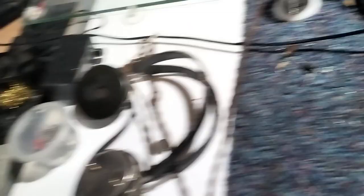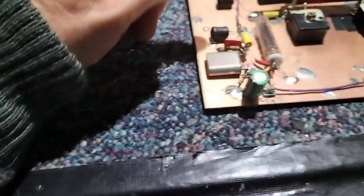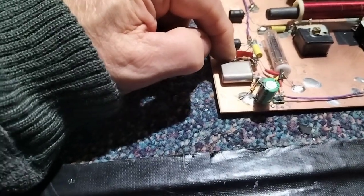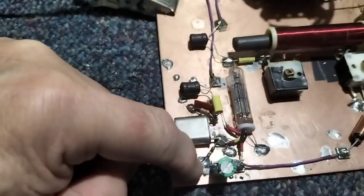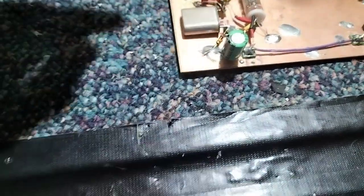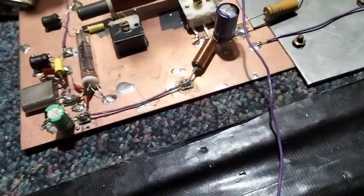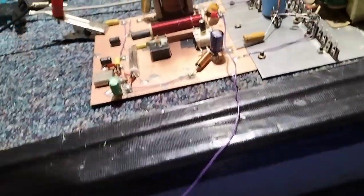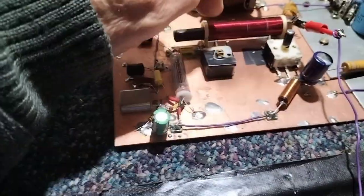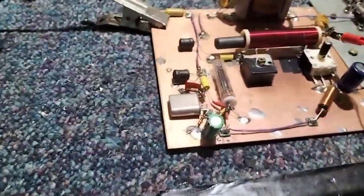The circuit is a bit different. I normally run the crystal directly between grid 1 and grid 2, but you don't need to do that. I've put in a DC blocking capacitor and a bleed resistor of 330K or 390K. There's a 100K down to grid 1, down to deck. That's a 2 mH choke, and it's a pi tank circuit. There's a choke on the other end which keeps the DC out. Any charge on the capacitor keeps it away. So it is a pi tank, although I think I'm going to have to rewind this — there are too many turns, or I still have to use this ferrite rod. There's not enough capacitance on the capacitors, but it does work as a pi tank should do.